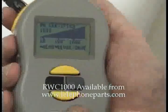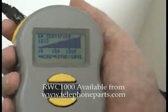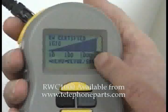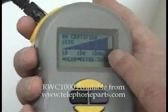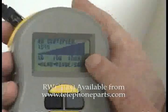Now, this is a screen I like a lot, because it takes the summary of the cable test and the data test and combines them together in one screen. We can see that this cable and that hub can run well above a gigabit, and there's a good margin for error. So this is a sound installation — this cable and hub, or switch, are a good combination, and we're going to have good, reliable results.